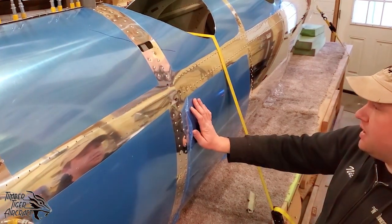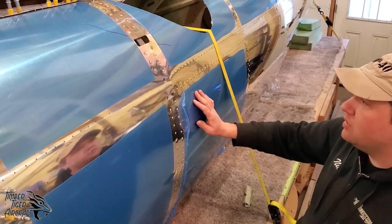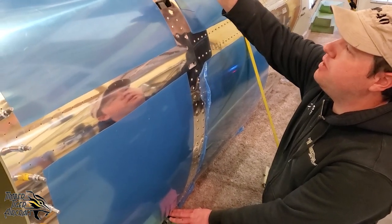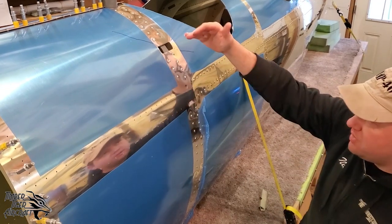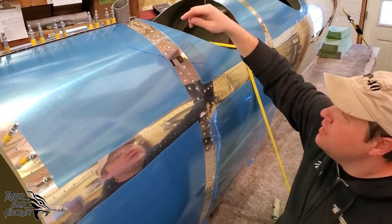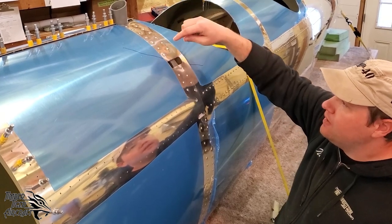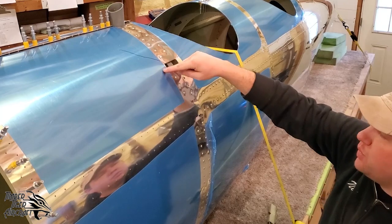Before we pull this plastic off this fuselage, one final note. When you're riveting bulkhead 2, focus on here to here initially, and then worry about from here to the rollover post after this is riveted. And make sure when you do all your drilling in bulkhead 2 that this is clecoed across the top. Now, if you rivet from the bottom up and just keep going, what can happen is you might get a pucker here. You got to displace this metal somewhere, right?